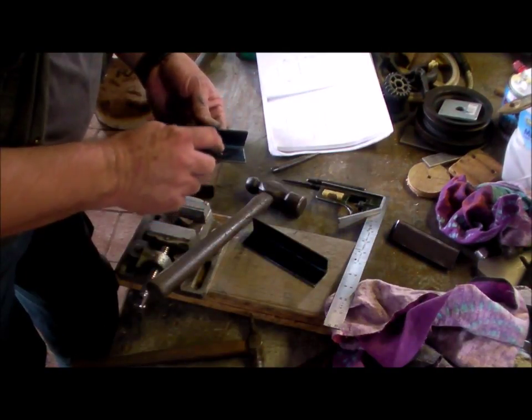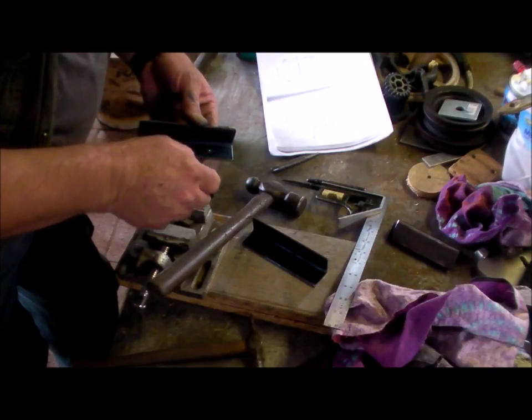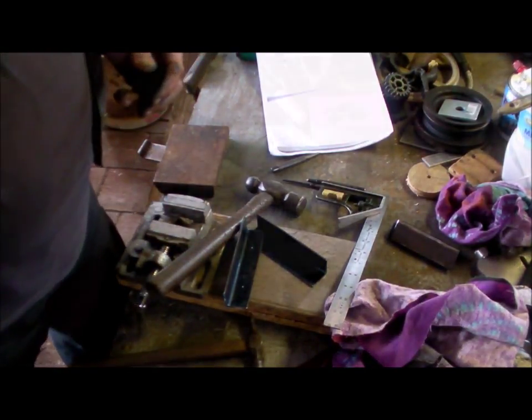No, that's all right. Once I drill the hole, then I can scribe a line to cut and create 2 adjustable slots.